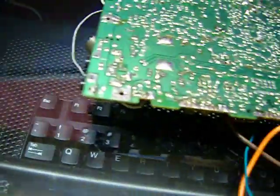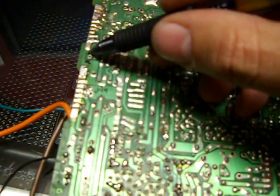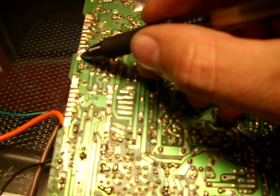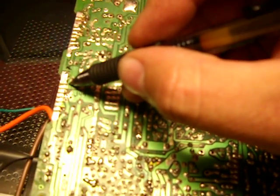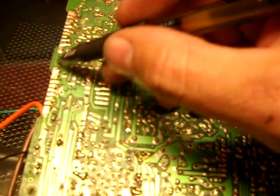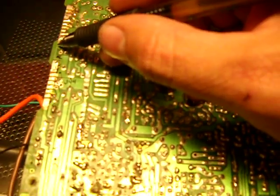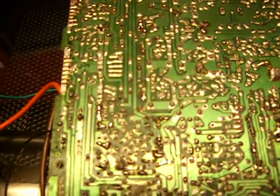The modification is done on the back of the radio. You're going to notice right here there's a trace that connects pin 1 of the TA7222 to pin 2 of the MB3756. So all of the power comes off of that choke through the TA7222 pin 1 down to this part right here.